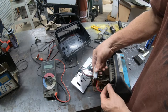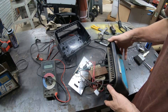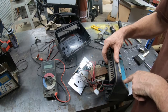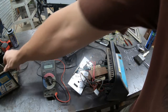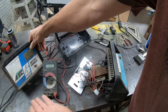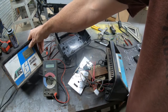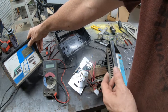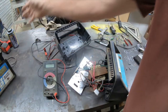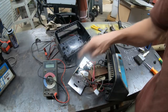You should never bypass the circuit breaker — that's important. Once I cut this out, the LED is not going to work, but we don't need it. The old battery chargers didn't have one. You just knew that if you plugged it in you had 12 volts, and if you hooked it to a battery it's charging — and you'd better remember you left it on charge or you'll boil them dry. That's what we're making this one like.